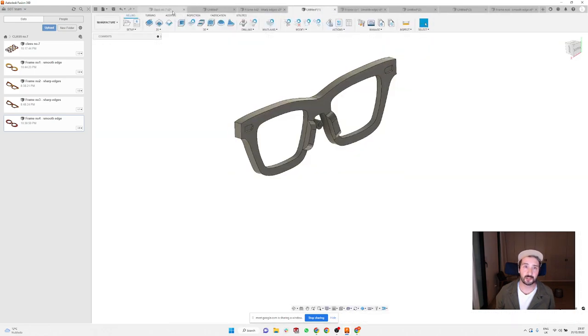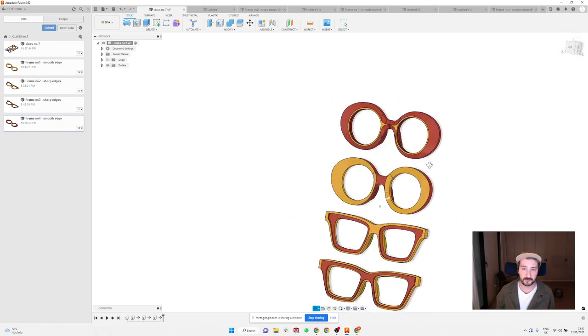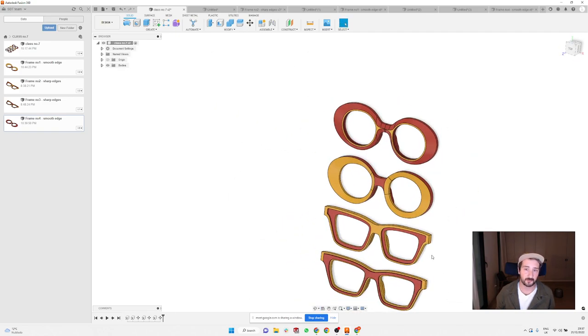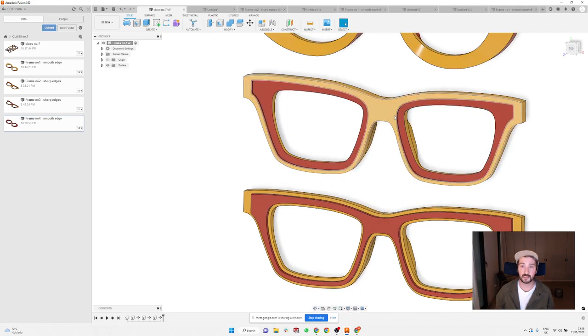Perfect. So guys, I'm gonna share with you all these frames, and you can just follow them. You can see all the operations, how it was done, how you can do it yourself, and how it behaves. If you need to take something from this class, always make yourself that reference point, because that's gonna help you to have this perfectly centered. If you do some machining on the front like this and you're 0.2 millimeter off, it's gonna be very visible. So you need to be really accurate with this.